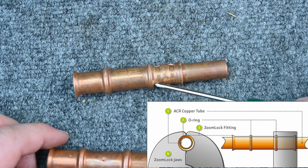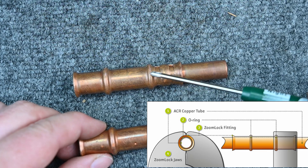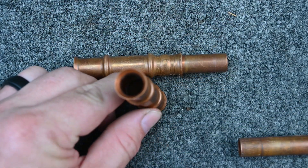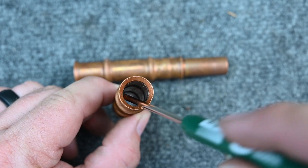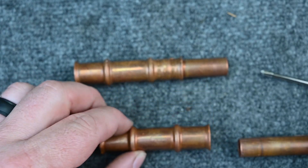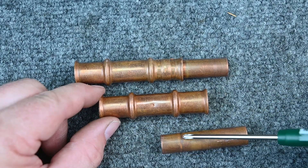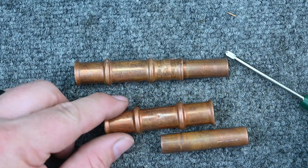It's not just that clamp that holds it together. Right here, there's an O-ring in this section. Right inside of here there's going to be a little rubber O-ring. Here you can see where I've had this pipe together in the past — there's a little groove right here. That's where the O-ring sits and presses on it right there.